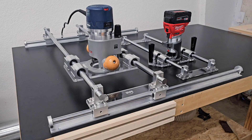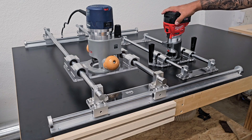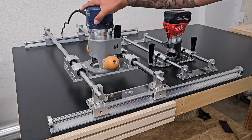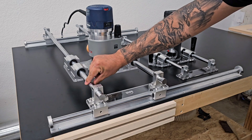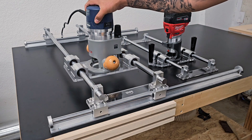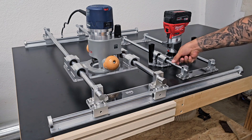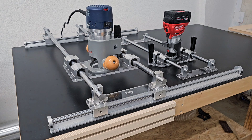What we have here are two sled assemblies: we have our full-size router sled assembly and we have our trim router sled assembly. I made a video explaining the difference between the two and I'll link them in the description. But in a nutshell, a full-size router sled requires 20 millimeter rods because of its heftier and beefier size, where the trim router sled has 16 millimeter rods because it's not as heavy.